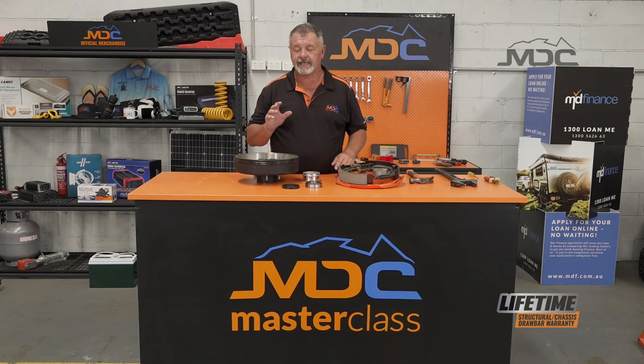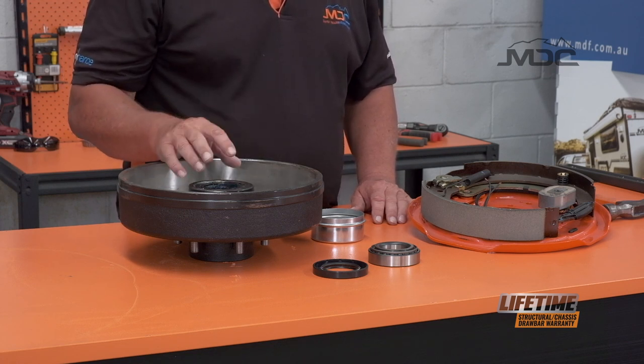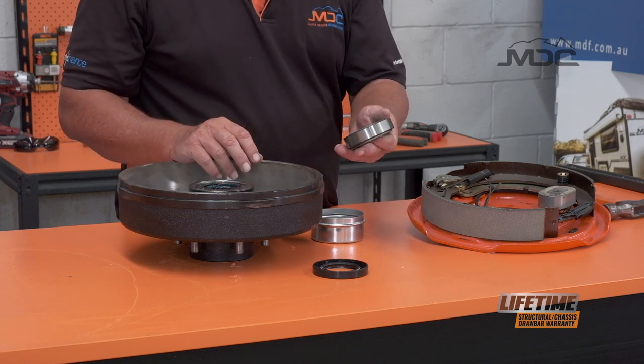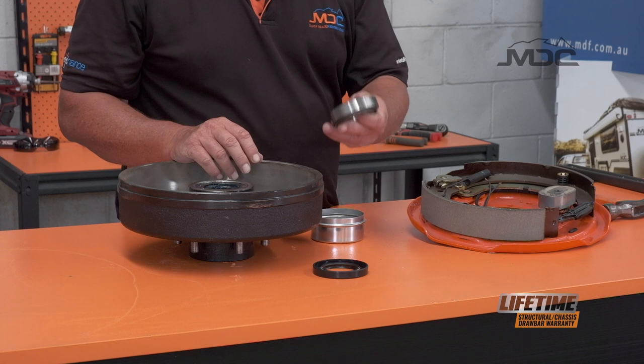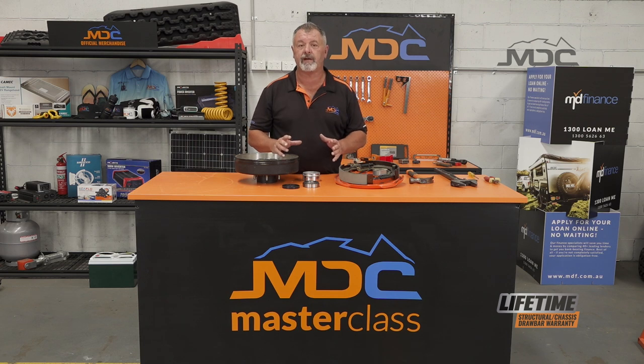You continue on — the full length of that track is about another 100 kilometres. You pop out on the highway, head home and park your trailer up for the next month or whatever until you've got more annual leave or another long weekend. Your trailer is sitting there with moisture in the grease and amongst the bearings, and simple as that, there is no corrosion protection on a set of bearings other than the grease. You do that sort of trip a couple of times and next thing you know you've only done a few thousand kilometres but you've tortured your bearings in the worst possible way and they fail.